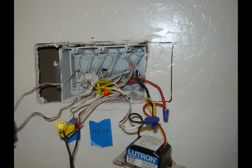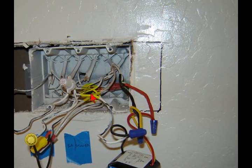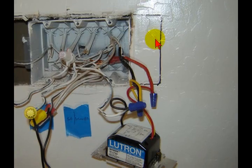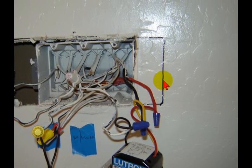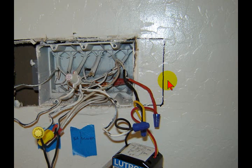In this picture I want to show you how somebody had taken the neutral wire and used it as just a switch leg, and used the existing ground wire as a neutral. This is a fan control box, so you've got the power coming in with a fan and a light. That's a particular type of dimmer they used so they could split up the bath bar light and the recessed can and have two separate switch legs without running new wires.